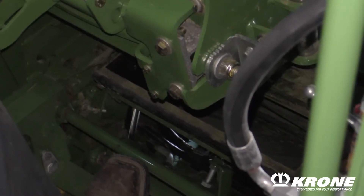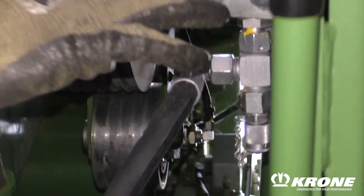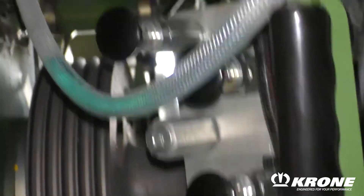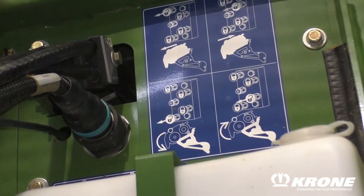Lower our Kernel Processor carriage — which is what my feet are on here — by the positioning of the valves at the valve block. The two lower sections here are for lowering the carriage. The upper section is for actually putting the KP into position. There's a diagram above your head up here, and you'll be able to follow those directions from here.